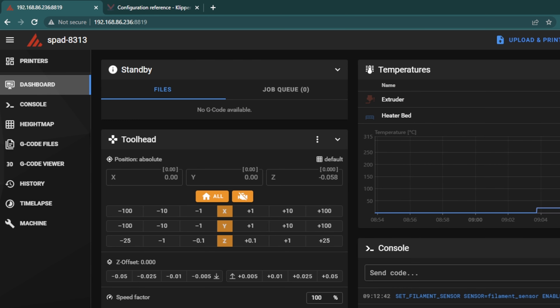Now let's get to the print results. Here are some examples of before and after showing just how good these things look. My biggest issue specifically with this Ender 5 S1 was that there was too much ringing in the prints — it's a box frame, but there was still a lot of ringing coming through into the parts. Now with input shaper and the accelerometer, it really cuts down almost all of the ringing, and you can print silk filaments really quickly now and get really great results.